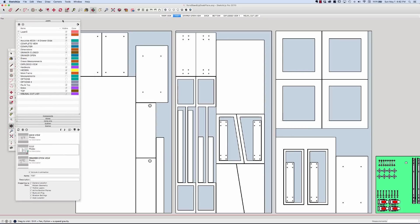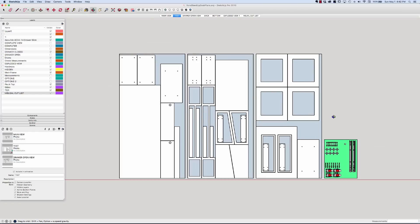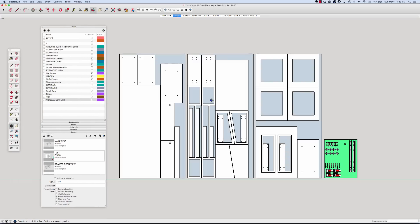That's kind of where I'm at now. I'm pretty close to taking this over to Layout and starting to make a set of plans. Before I do that, I'll make a copy of this section and call that 'parts,' and I'll separate these instead of being laid on plywood - I'll put them together by common parts in such a way that in Layout I can go in and put dimensions on them. This would be the visual cut list for showing how to cut out of plywood, but for showing how to make each part I want a different layout. I'll have a separate page in metric and an identical page in Imperial.